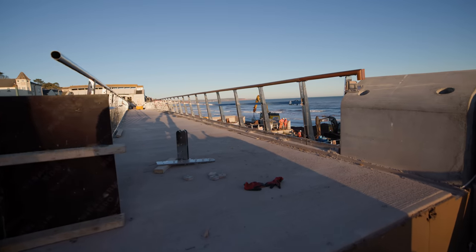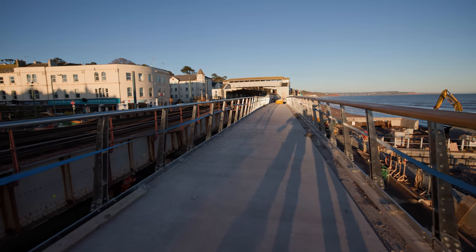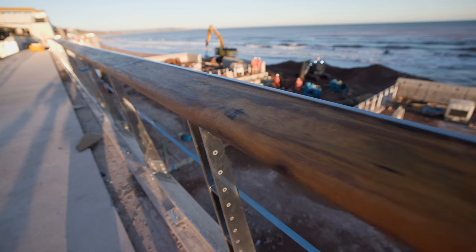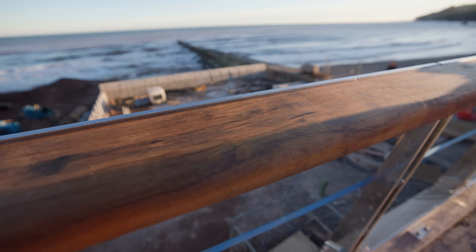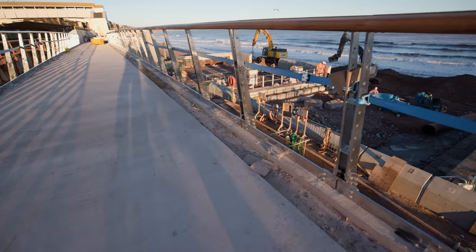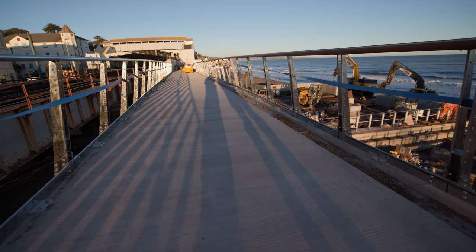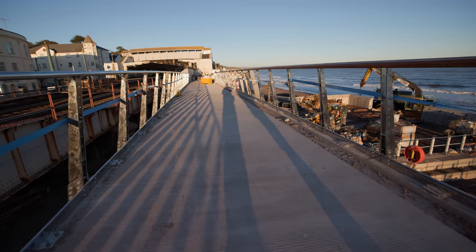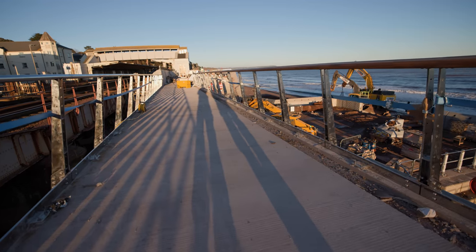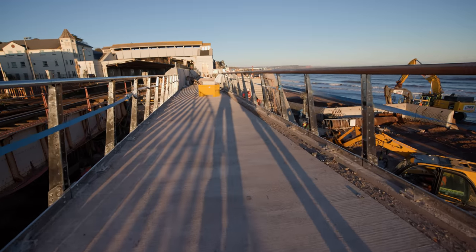First non-rail-related worker to walk over the bridge! On the left hand side we've got the stainless steel system and stainless steel hand railing along the top. On the right hand side there's a leaning edge so people can admire the view and look out to sea — made of stainless steel on the front and underneath, with a piece of marine grade timber on top. The rebate on the floor is where the drainage channel goes in. The water falls from left to right and there's a longitudinal fall on the deck from the centre so water runs off both sides. At the bottom of each section of stainless steel fencing there's a stainless steel kickboard to stop materials rolling over and dropping down onto people walking underneath.